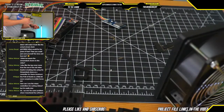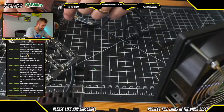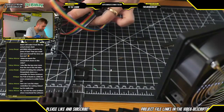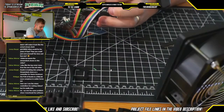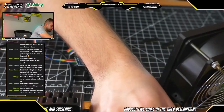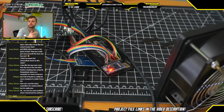Excellent. All right, so here is the other USB cable, which is the micro. It's a little bit of a bigger connector. What I'm going to do is carefully move this around and plug this in just like this to here. Again, trying to make sure that nothing is touching. And then I'm going to plug this guy in. Okay, again, both power rails are connected together. So when plugging one USB cable into either Arduino, it powers both Arduinos up together.